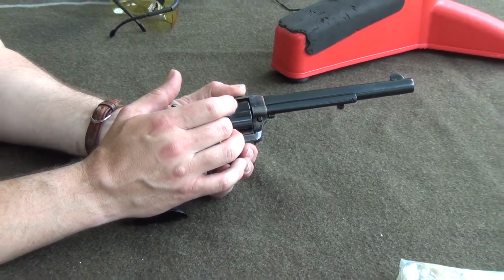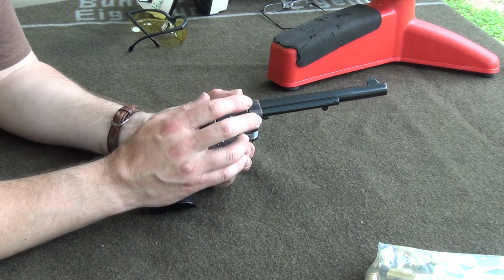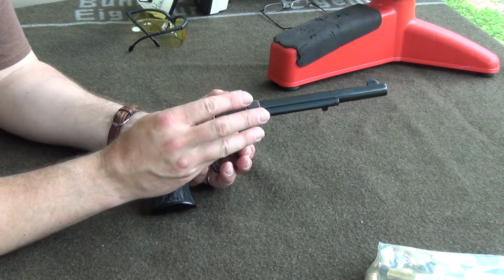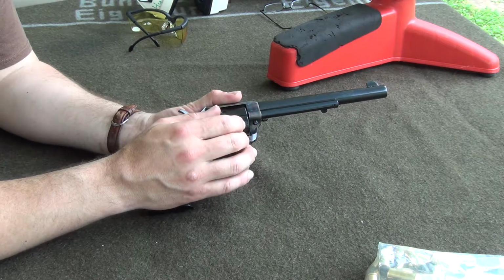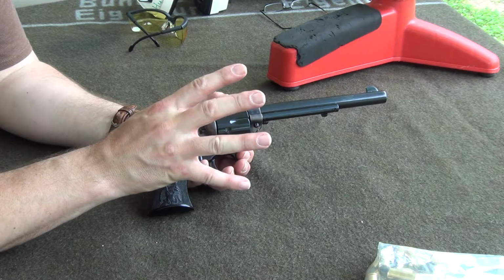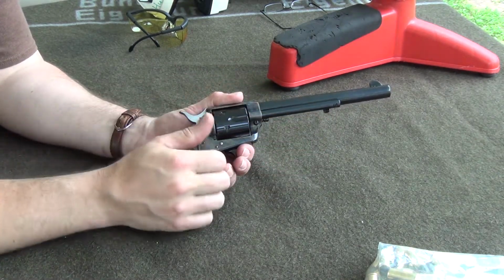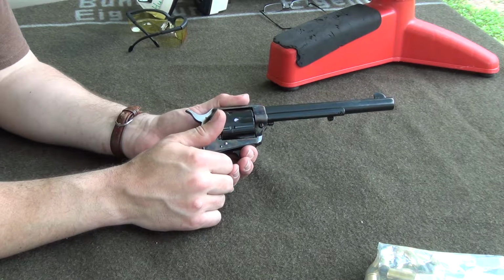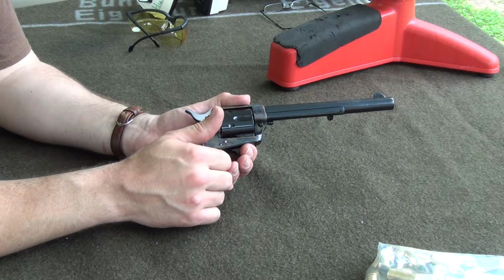And what that meant was, as the cartridge case swelled, yes, it contracts a little bit after the initial firing, but the final shape of the formed case was larger at the front than at the rear. So when I was trying to eject it, it was having to squeeze back down to get out of there. I briefly entertained trying to ream it out, and that was impossible.